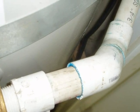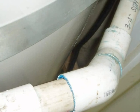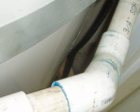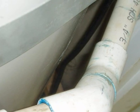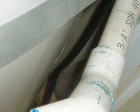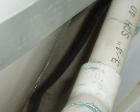Here's another common but unacceptable installation using PVC plastic. PVC is not rated for use with hot water. The TPR drain line must be made of an approved distribution pipe, usually rigid copper or CPVC plastic, and there can't be any pipe threads on the outlet.